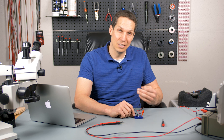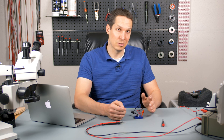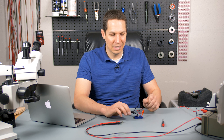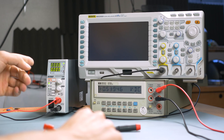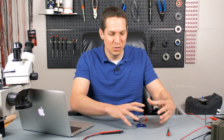In an ideal circumstance, this 100 ohm resistor would be fairly high-powered — something like five or ten watts. Unfortunately, I don't have many resistors that aren't basically quarter-watt or even eighth-watt, so we're stuck with a quarter-watt 100 ohm resistor as the safety barrier. That means we can't go too high with our incoming voltage during testing. That is one of the challenges — you have those four variables, and as one changes, everything else has to adapt or you lose efficiency or run into other problems.